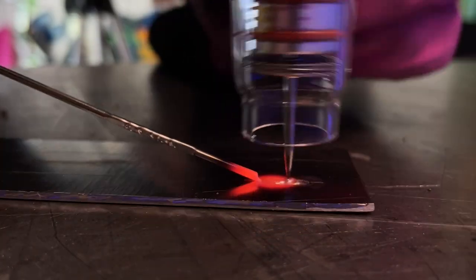Take a look at this right here — we can clearly see the weld pool. There is going to be a sweet spot where your filler material is going to break off into the weld pool easiest, and when it does so, it's going to go in as smoothly as possible. What is happening when your rod gets stuck is the material is being fed too close to the leading edge of the puddle. Your filler material is not breaking off cleanly and smoothly into the weld pool — it's only partially melting and sticking to the leading edge.